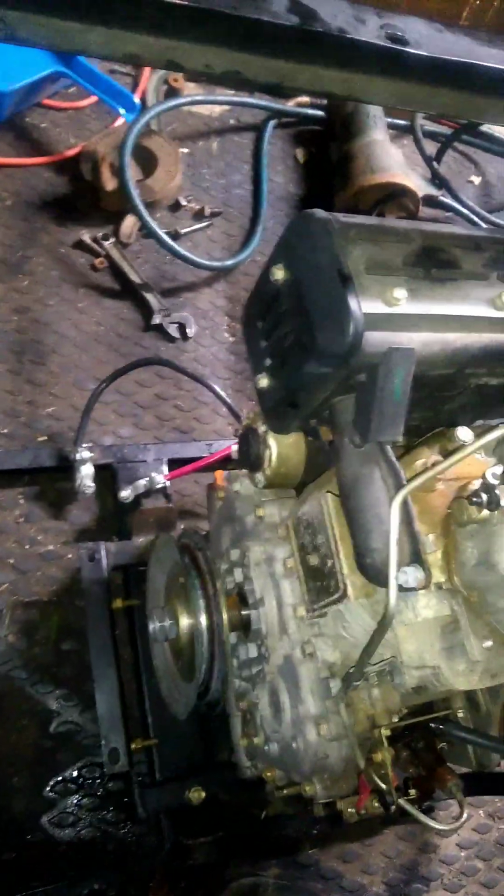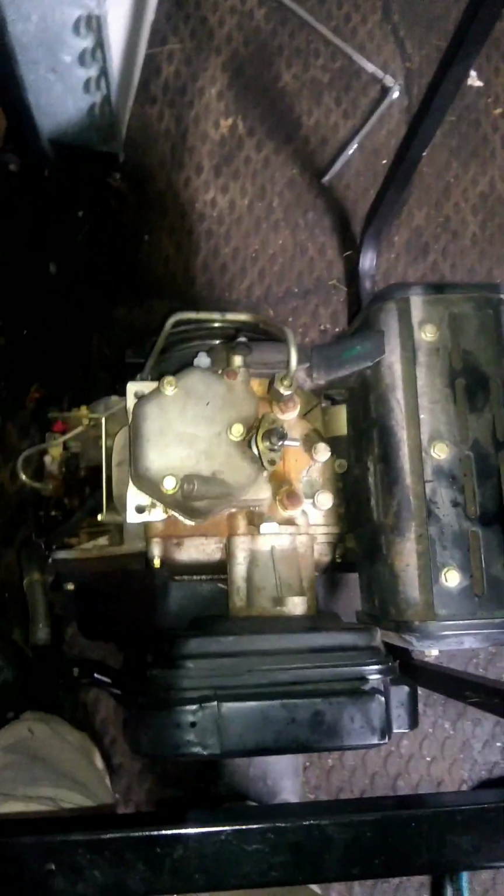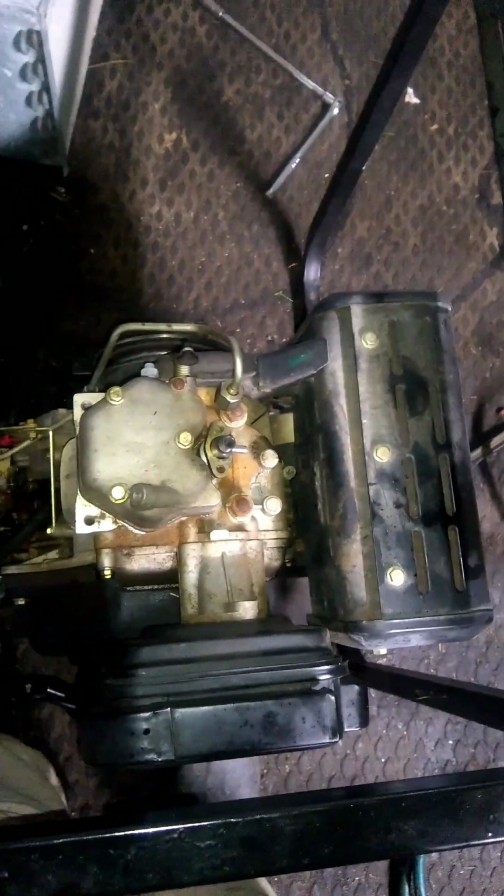It also is electric start. The old starter under there. So that's a nice feature on an engine like this. With that much compression, 21-to-1, because race car, it's kind of a handy feature to have electric start. I have tested this down to like 26 or 28 degrees on straight waste oil, and if you've got enough battery to spin it over that morning, it will start, and it'll start pretty easily.